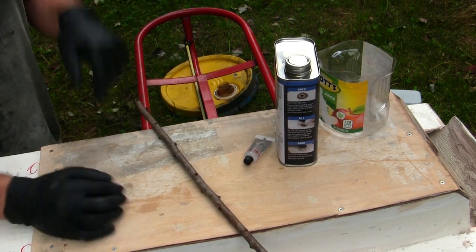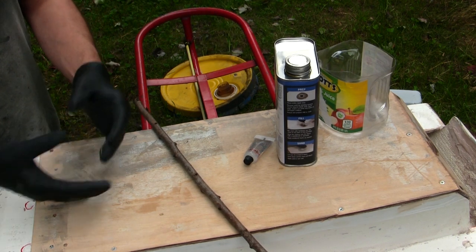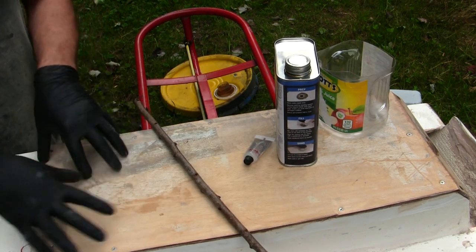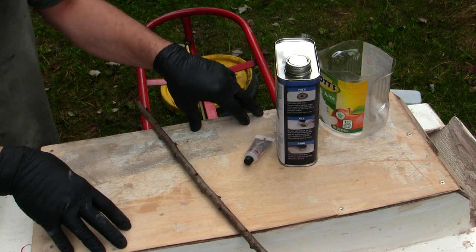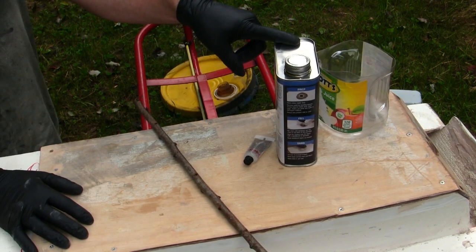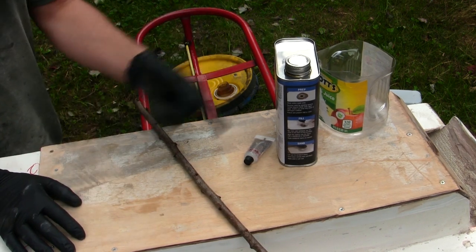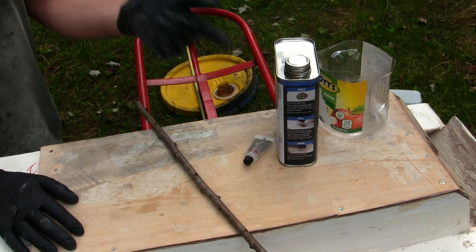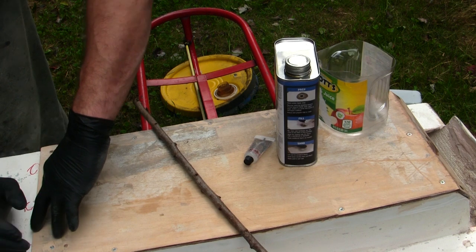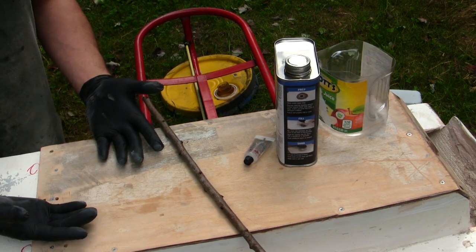First, with the foam brush, like I said before, this stuff is very abrasive, and the foam will start decaying on you shortly after it starts setting. So when you're doing the application, you're going to have little crumbs of foam embedded into your surface that you're going to have to sand away, and it makes the job a little bit more difficult. Similar is true for the brush. Those cheap brushes, not only do you have brush hairs embedded in the fiberglass, but when it starts setting, it makes a rake type appearance with the brush strokes. And again, it's not really beneficial.